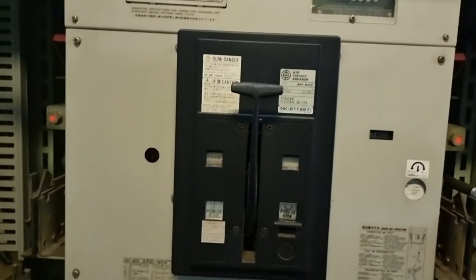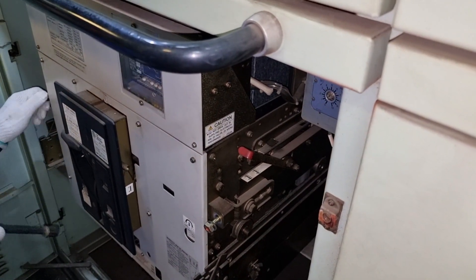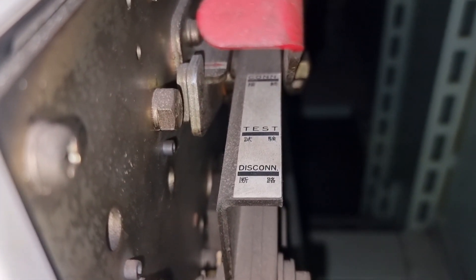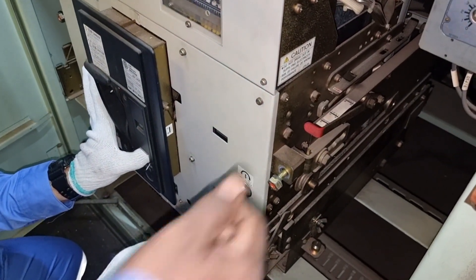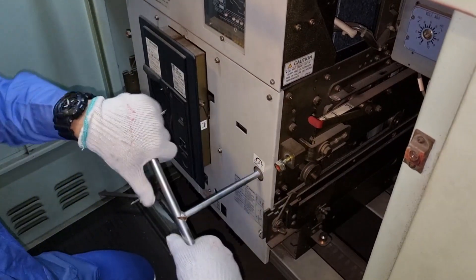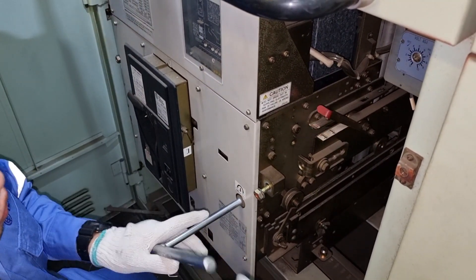So we just need to remove this one. After taking out that special tool, we can unscrew these two bolts. So these are the Terasaki technicians who are doing the racking out so that I can show you the step-by-step procedure. After releasing the bolts, we can push this lever down on both sides. After that, we need to push this up and then we can have access through this hole. Then we can insert the proper tool and start racking out the air circuit breaker. Notice the red lever that we push down — this will go all the way down, which means the air circuit breaker is in test mode.